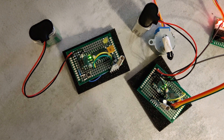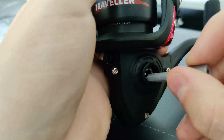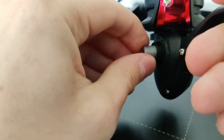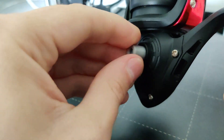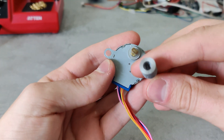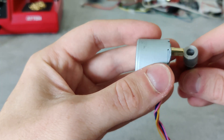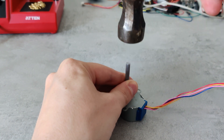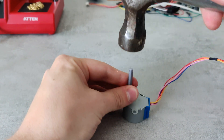These are now ready to mount. There are a lot of 3D printed parts on the mount. I'll explain what every part does as I assemble it. This was probably the part that needed the most precision — since we are replacing the hand reel, one end has to fit into the polygon-shaped hole in the reel and the other side has to fit in the motor. This was made to fit tightly and had to be hammered in. I tried not to hit too hard to avoid damaging the motor, which is why it took some time.